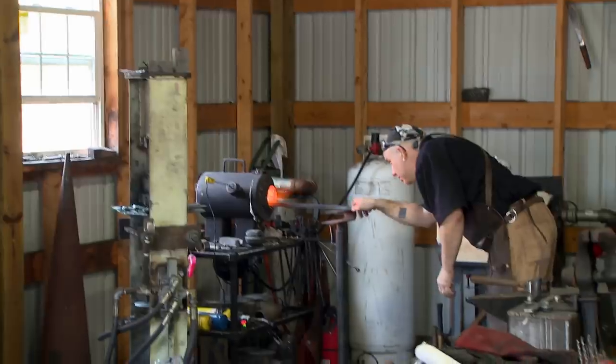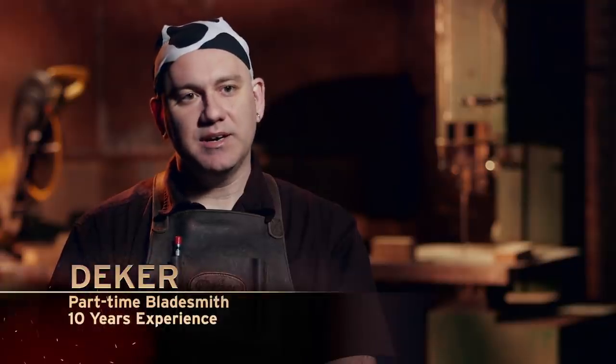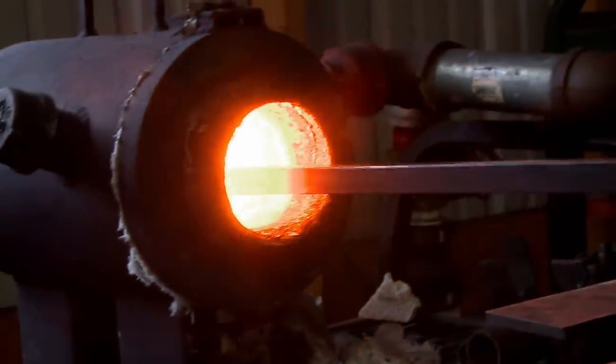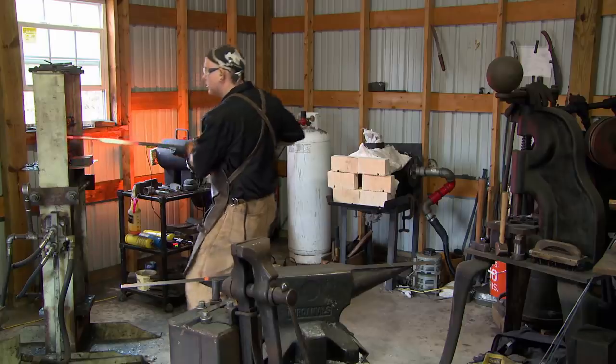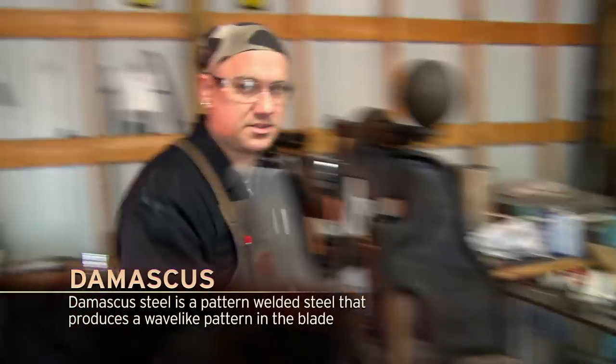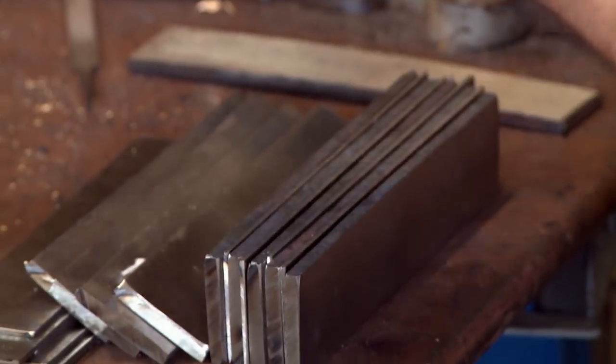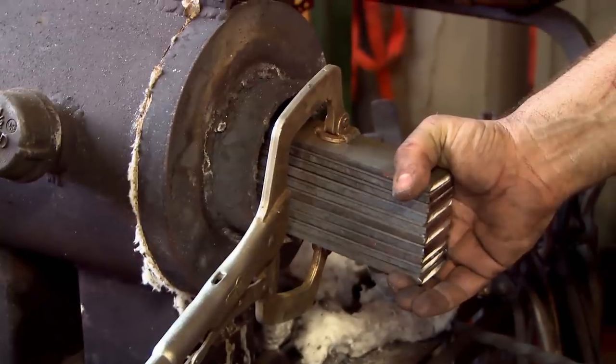I'm Decker. I work as a computer security consultant. Blacksmithing and knife making is sort of a sideline that I do as a little bit of therapy. I'm planning on doing some pattern welding for this project. If it's worth making, it's worth making in Damascus. This piece here is going to turn into a long bar of steel, then get cut up into sections so I can stack multiple layers together in a billet to weld.